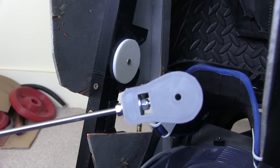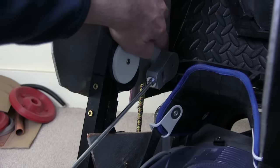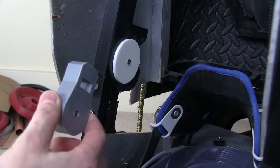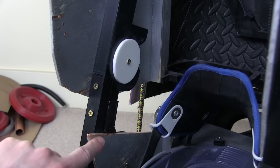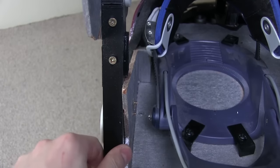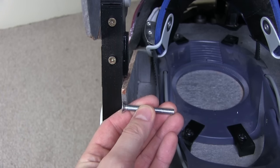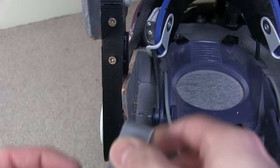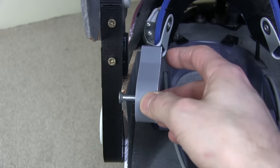I've attached that to the rod at one end and you can see I've got lock nuts in there with big washers on each side. That one is going to mount right on this piece of wood so I can put a screw through. The problem is it has to fit on here and this is just a 6mm piece of plywood — if I bolt through I'm going to have some issues because the other lock is on the other side and needs to move past. So I'll use a countersink bolt, but I'll stick another bit of plywood on the inside so it has something to attach to with a nut, and that should be nice and strong.